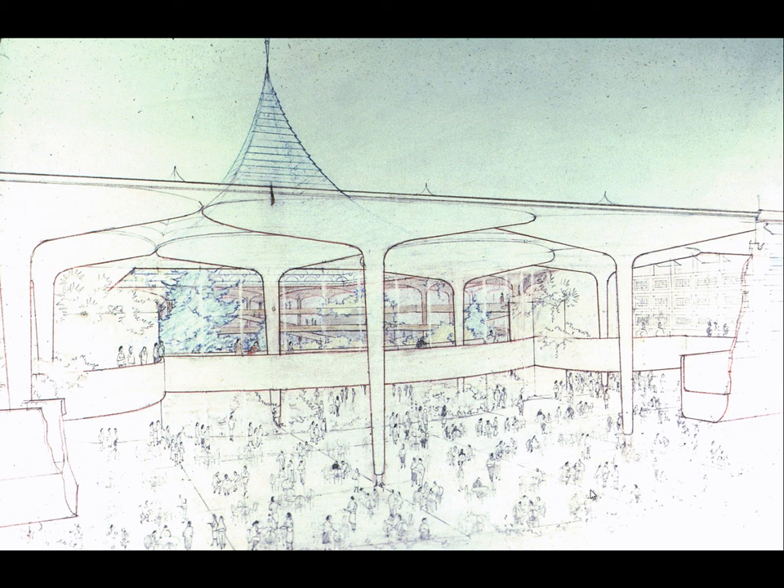Frank Lloyd Wright had a gift for structure in certain regards and some of his designs were intuitive and clever — though some were really bad also. He had major problems with Fallingwater, which he tried to blame on the contractor, but were actually his fault. He under-reinforced the decking and it was not thick enough. It was a major headache to get that fixed eventually. To the very end he continued to blame the builder, saying the builder had too much steel in the deck, when in fact it was the exact opposite. So we have to look critically at whatever his claims were, but for sure he was good at showmanship and got a huge amount of publicity out of the testing done of this particular structure.